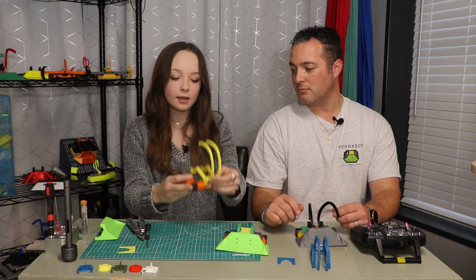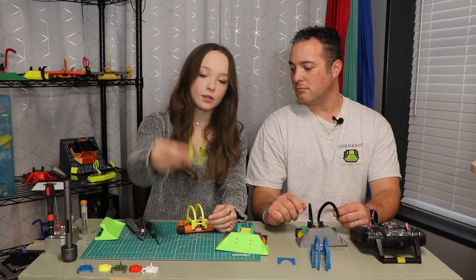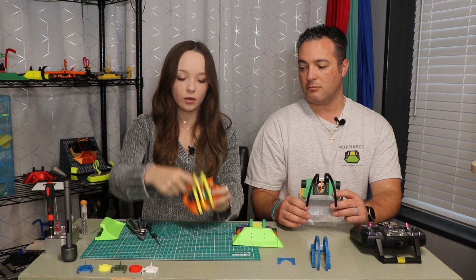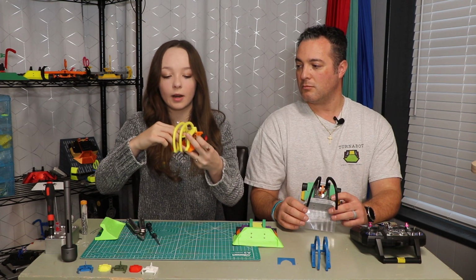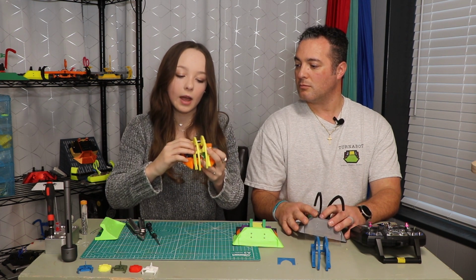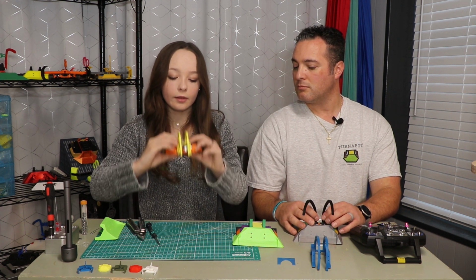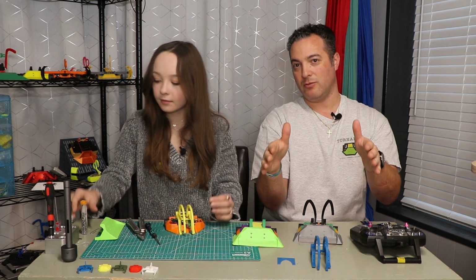So then once you do that, you can actually put the top armor on, and it has a little U in it. You can't use the same top armor for the slipper and the slammer, because of the servo arm and the link, you don't want it to accidentally run into it. But it'll have a U in it, and that should be facing the back of the bot. Just make sure that the correct side is up. The armor does all have chamfers, so that they're angled down towards the chassis.